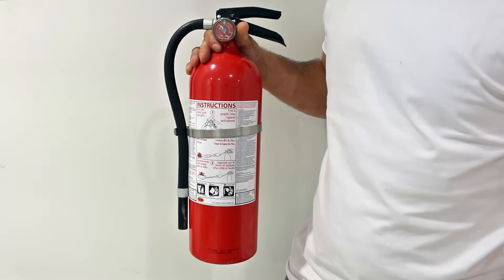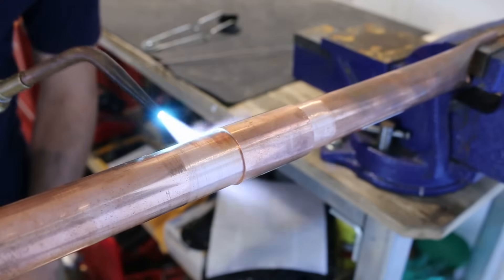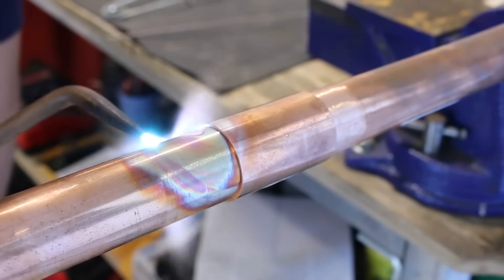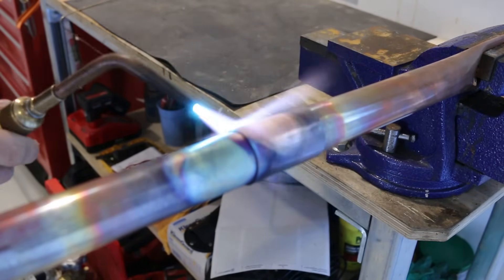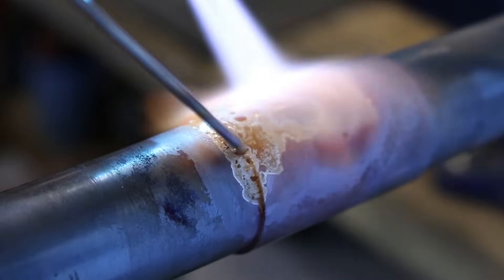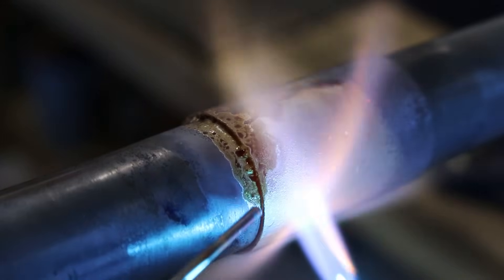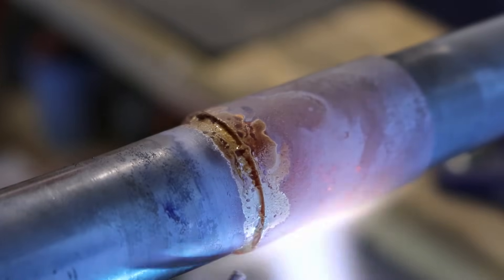Before brazing, make sure your pipes are well supported and have a fire extinguisher as a precaution. The first part to heat is the pipe, because the small air gap between the fitting and pipe doesn't transfer heat well, so it must be heated independently to reach brazing temperature. Once the pipe is heated, start heating the fitting's hub, always staying in motion. Every once in a while, test with your filler material — once it's hot enough you'll see it start to melt. Make sure you don't heat the filler material directly; you want the heat from the joint to melt it. You may notice the pipe becoming red hot — don't apply more heat than that, to avoid overheating.